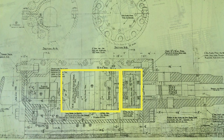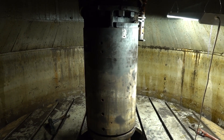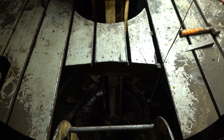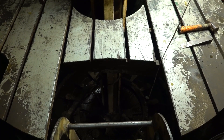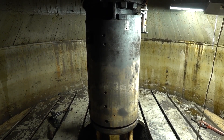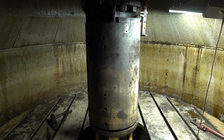There's a motor and a gearbox inside there, and we've got to swap the motor out. That motor adjusts the blade pitch angle on the turbine hidden down in there. We showed you the turbine last year — I went down, did the whole thing, showed you all the turbine blades and everything. The pitch angle on those turbine blades is adjustable by a motor inside there, and the motor's just pooched — it's bad. So we're going to swap that out.